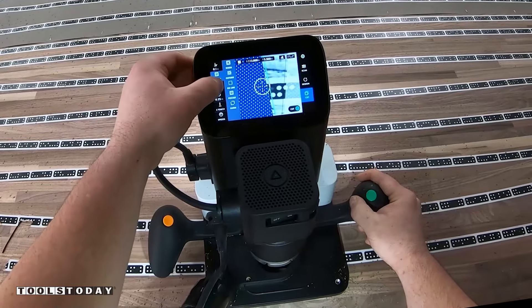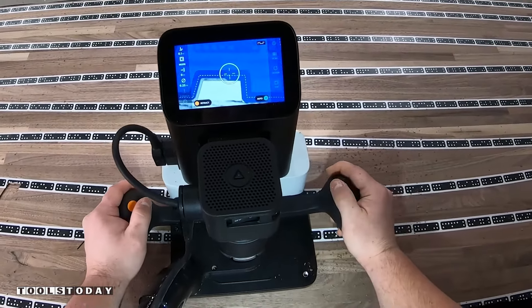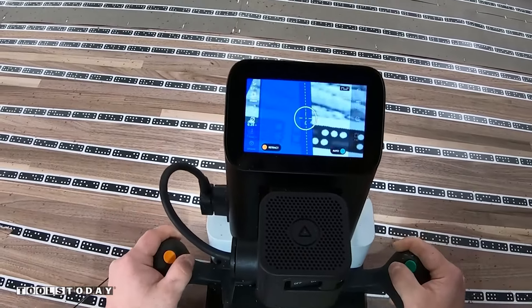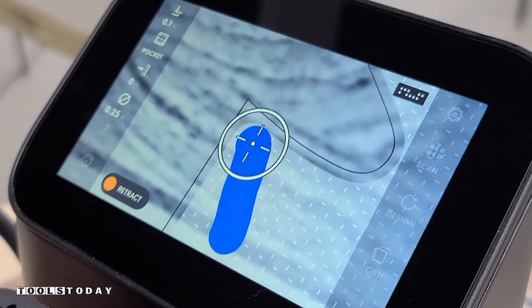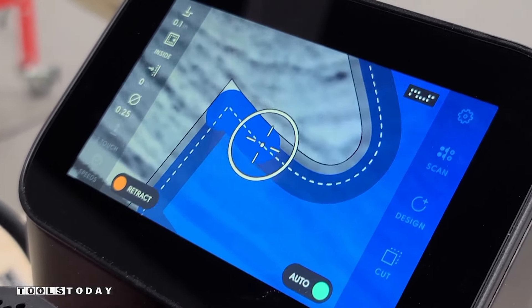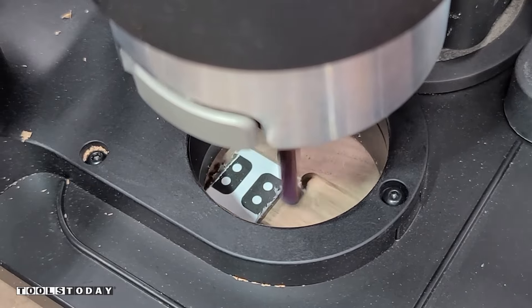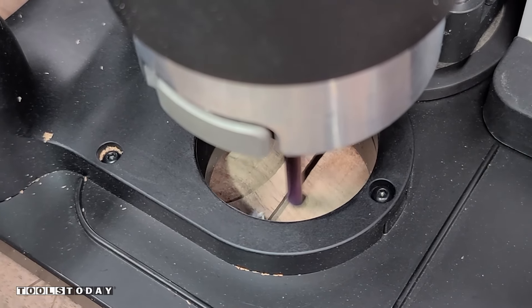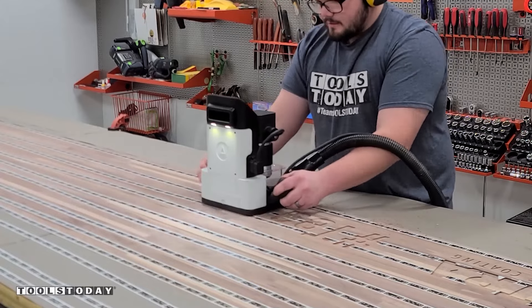After that is done, we'll switch to an inside profile cut to get the outside edge of the letter. We'll just move around and, as you can see here, we're using that green button to get those corners — it can move within that white dot to correct your movement. If you move outside of that area it will automatically shut itself off so that it does not cut into the area that you don't want it to. It leaves really nice clean cuts, and it's pretty incredible — I'm not being absolutely perfect here and the machine is correcting the movements to make sure we get a nice accurate cut. If you were to jerk outside of that cutting area, it will lift the machine automatically to save you from cutting into your design.